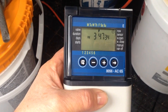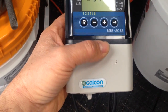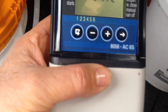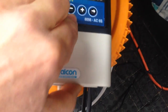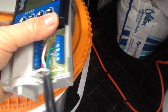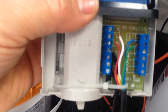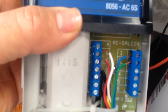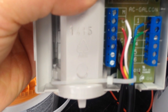This is our GALCON irrigation controller — I'm going to call it that because the full name is a mouthful. You can see the name and part number up on top. Let me open this up so you can see the wires I put in. To the left I have the common and to the right I have numbered one through six, so I can control six different sprinkler heads.